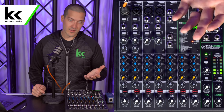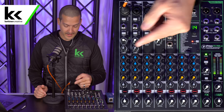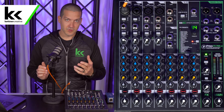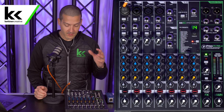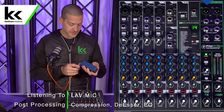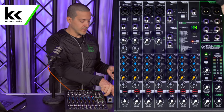A question we get a lot: I don't think we're getting too much noise with how hard we're pushing the preamp at this three o'clock position at 75%. But a lot of people do want to hear it with and without a cloud lifter or inline preamp, so we're going to do that now. I'm going to unplug the microphone and plug it into the cloud lifter, then connect the cloud lifter to the audio console into channel 2 so we can compare the differences between the two.